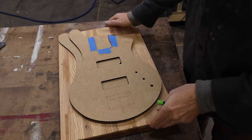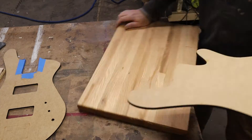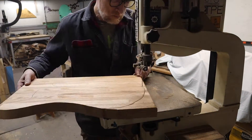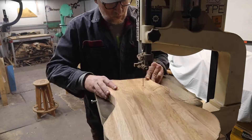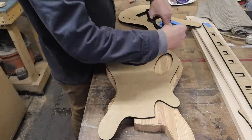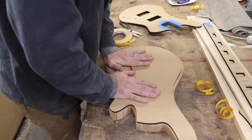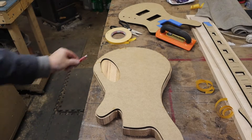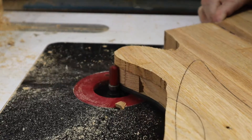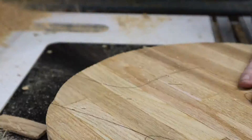The router templates for sale are a little bit different than what I'm using here — these are my first prototypes. One of the problems I had was the neck pocket was a little bit wide on that first one, which is why I have some tape there. The top template has a little extra material on it instead of that second horn, just to help with the router sled. The back one is the one that actually gives you your shape. I began by cutting out my shape roughly on the bandsaw, making sure to stay clear of the lines. Using some two-sided tape, I put my template back down, then moved to my router table to trace that template and get my final body shape. These router bits called pattern router bits have bearings on them, and it really helps to have one in both ways — a bearing on top and a bearing on the bottom — to get these slightly thicker guitar bodies.